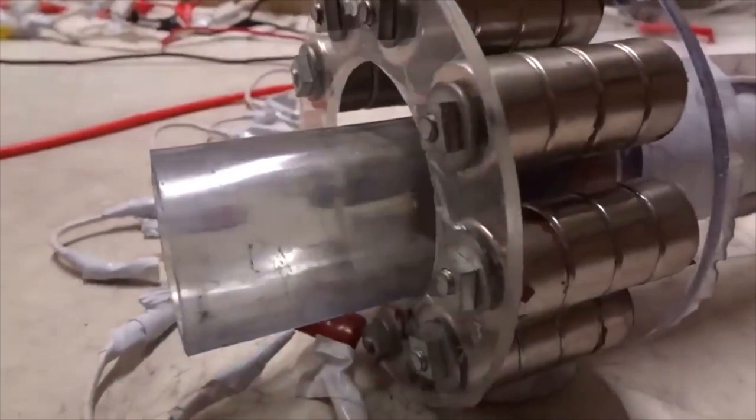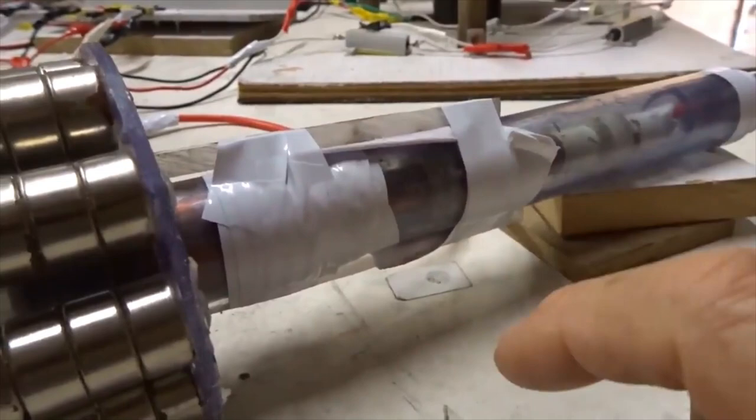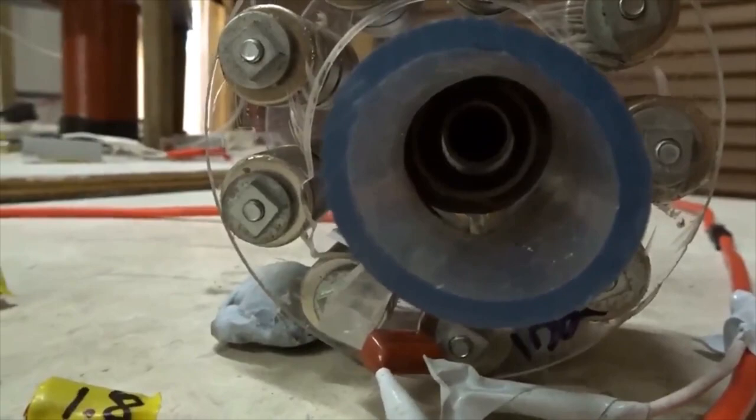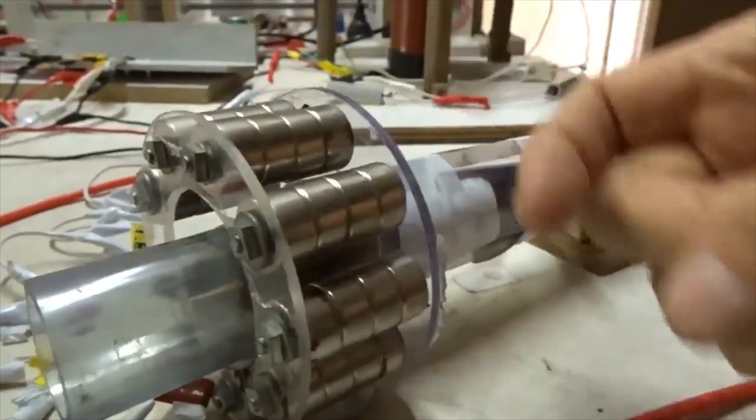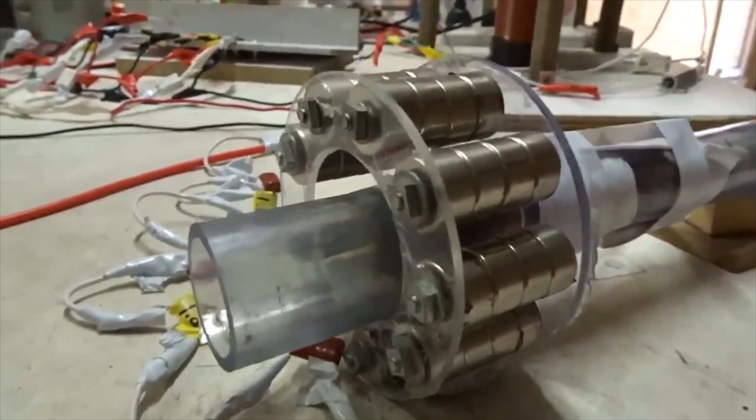What's happening is these two wires here and here attach to two different concentric copper tubes to give it plus or minus 2000 volts DC. Now, when that ionizes the argon gas, the argon ions sit on the inside copper tube and the electrons on the outside, so it's a circular capacitor. Then when we add this magnetic field, that current begins to spin like that. And also, because there are radial components in this field, it discharges that way. So all that huge electrostatic energy of the capacitor shoots out again, more than just the spin.